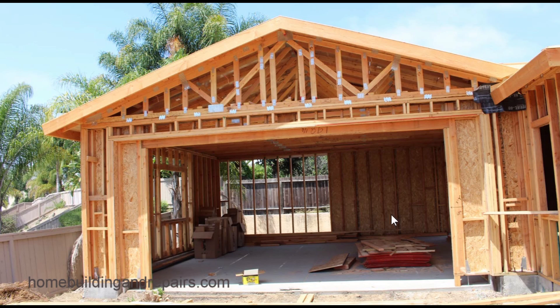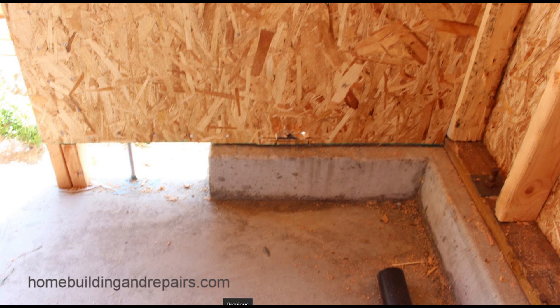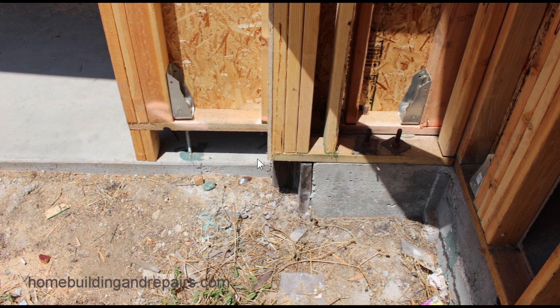Here's actually what inspired this video — I came across this house where someone missed the footing by quite a distance. I'm almost positive this foundation was originally poured for a two-story home, and then someone did modifications later. They went in and epoxied some all-threads to pick up the hold-downs, and just filled this area in with what I'm guessing is just concrete. And I can't see it getting a lot of support — maybe eight inches tall, six inches wide, with some rebar in it.